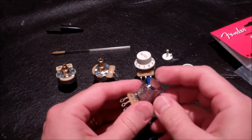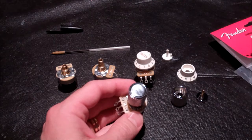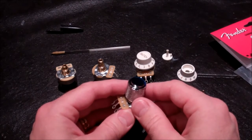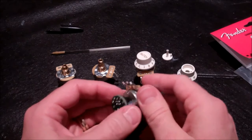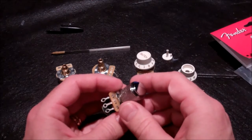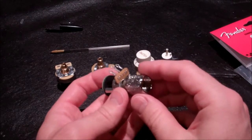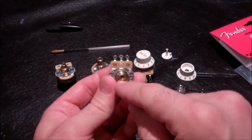Here's an interesting alternative: I cut tubing to about 13/32 of an inch — just over 10mm — which is a little too long. With this longer tube, the button is above flush at rest and presses down to flush, rather than being flush at rest and popping up. If you prefer that behavior, you'd just wire the switching contacts in reverse. You can vary the tubing length to get whichever action you want.